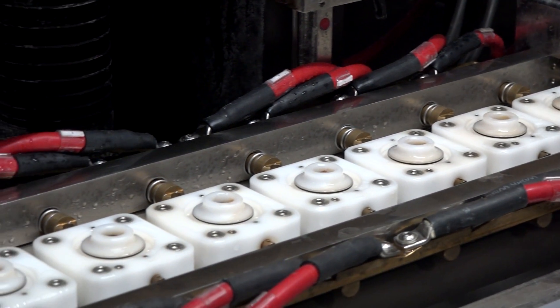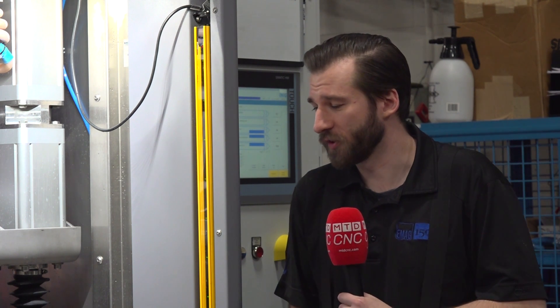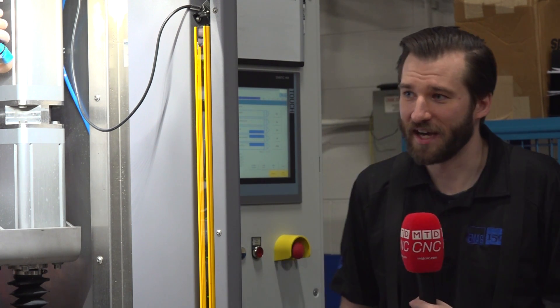Within this gap we have electrolyte that flushes and cleans the work area. Because you're not putting any hard forces on your tools and not touching the workpiece, you end up with a tool that lasts until you short it out or someone breaks it. In cases where we do have wear — such as rifling — there's a per-barrel limit, but we've found it's quite a large limit because the tools are really just sliding on metal, not pushing on it, cutting into it, or gouging it out.